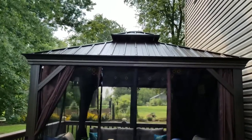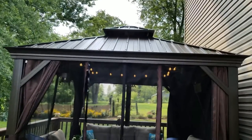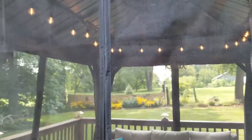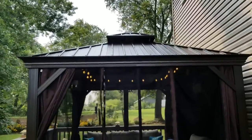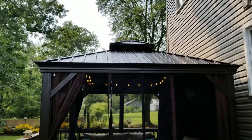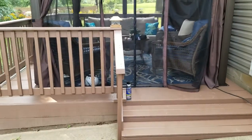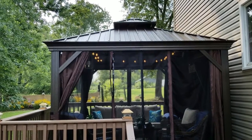The other thing they should have done is include rubber washers to go under the bolts as you put the roof together, because on a very hard rain if everything isn't tight you might get a leak or trickle off one of the nuts and bolts. I found that out the hard way. My fix was some black silicone caulking I had from another project — I went up and lined all the bolts on top so there would be no more leakage. That's it — this is Jetman and I'm out.